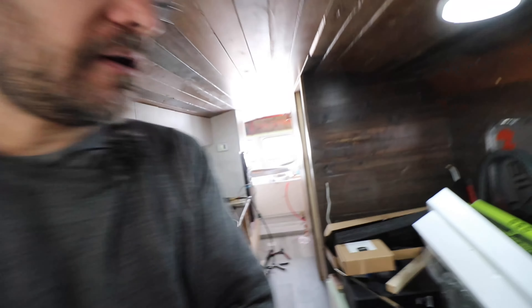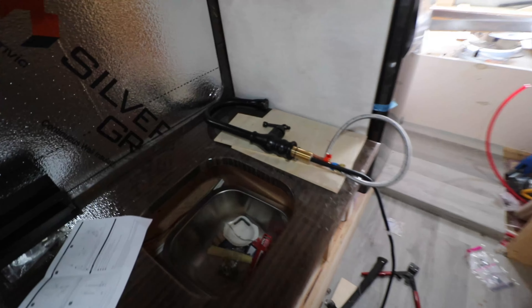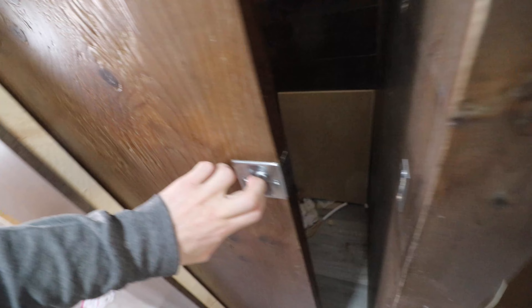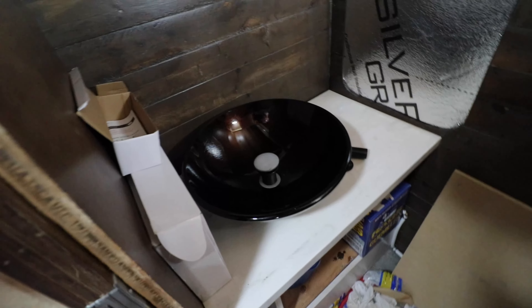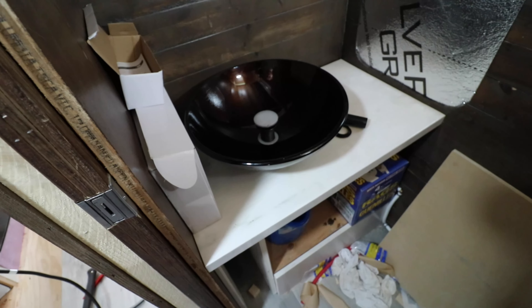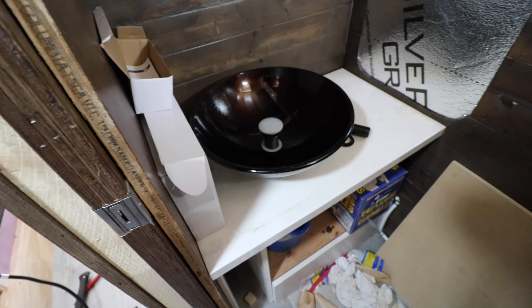Okay so that's it for today. I had to do some cleanup, then I decided on what I was going to do next, and then it was just too late to do it. What I was planning on doing was: first I have to install the tap before I can install the sink, because it's an undermount sink and the sink would just get in the way of the faucet. Then over here in the bathroom I was getting ready to do the same thing in there. I had to pull all of this stuff out of storage, which took a little longer than I expected.